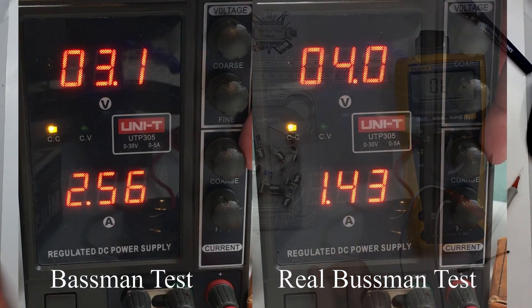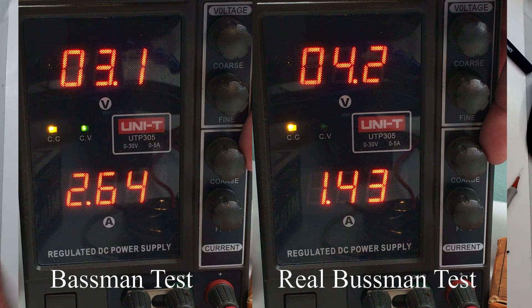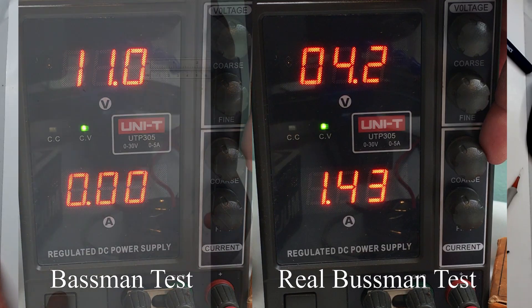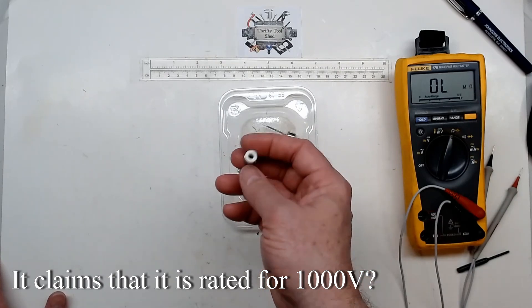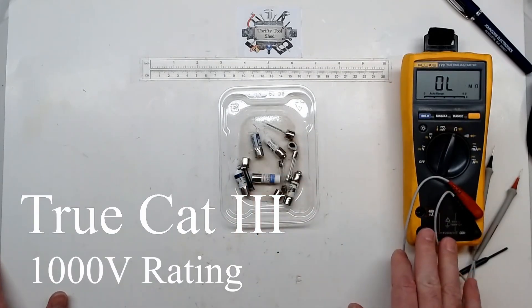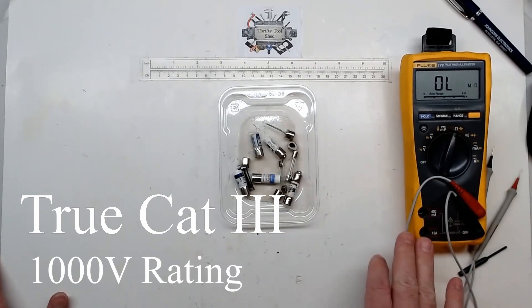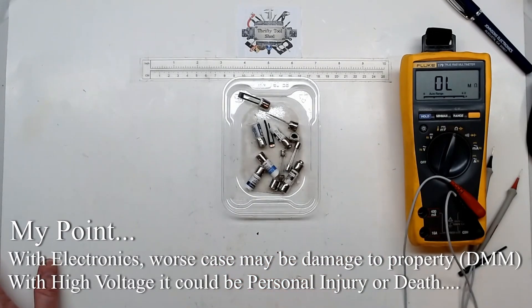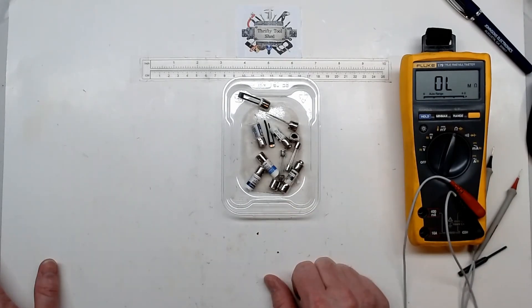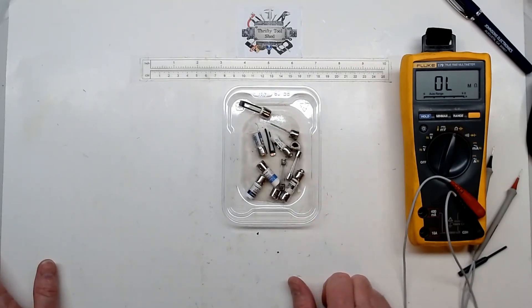That's just a quick comparison. Once I realized the fuses were fake I thought it was worth showing the differences. These are rated for 1000 volts but I would absolutely not put a knockoff fuse in a 1000 volt device — your meter will have a category safety rating, so common sense says buy the known-good rated fuse. For bench work with low-voltage electronics the cheap fuse is probably okay — better than nothing. I'll leave it up to you to decide, but I just wanted to share what differences I could find. If you liked this video please like, share, subscribe, and thanks for watching.